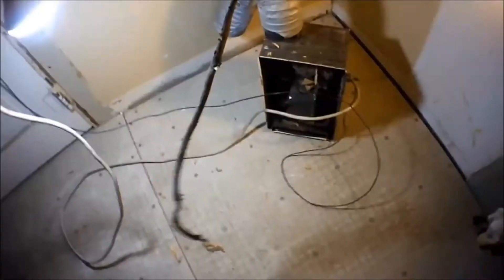I got most of that trim off and I found an electrical wire hanging from the attic — it was still active and just dangling there. I went up in the attic and disconnected it from the junction box. There's another wire coming from up there too — that was the wire they were using for the fan light, so I'll have to go and rewire that somewhere else.